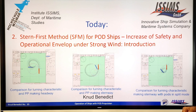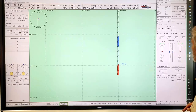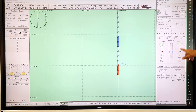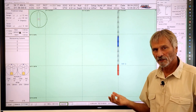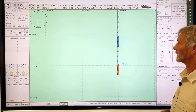We are using the Summon tool for this comparison. For our sample scenario we are using a cruise ship which has two azipods and also bow thrusters. The ship is making headway at 4.6 knots going ahead, based on engine order telegraph settings of 20% ahead. The ship is just proceeding, so I moved the reference position a little bit ahead. Now we will compare what happens if I use the pods or the bow thrusters to generate a turning circle.